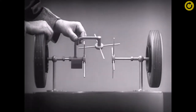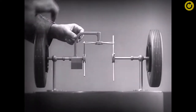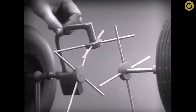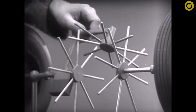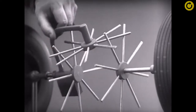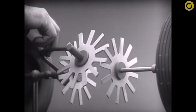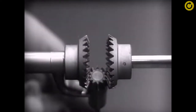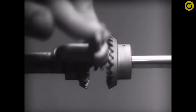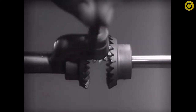To adapt the model for use in an automobile, we will have to make a few changes. In order to reduce the jerky action caused by wide spaces between the spokes, we will put in more spokes. Further filling in the spaces between the spokes gives steadier, more continuous action. And changing the shape gives firm, constant contact. Now we can make the gears thicker and stronger, and we have differential gears. The edges are cut so that they will fit together more smoothly and silently, and another gear is added to share the work of driving the axles.